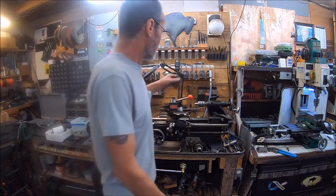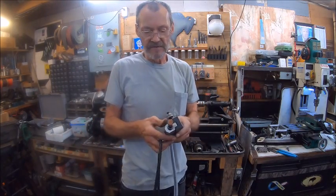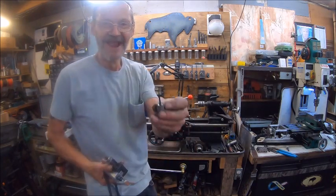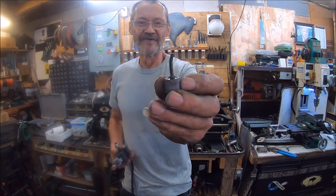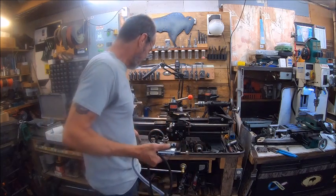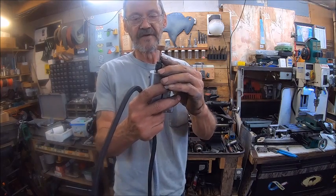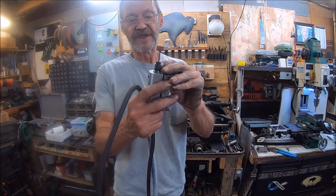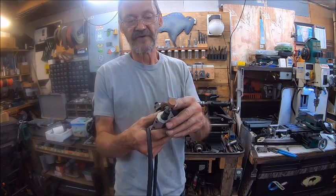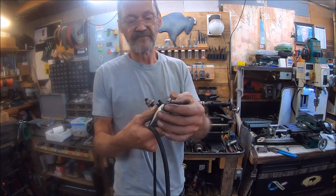Anyway, that's my tool post grinder. Temporary one. Lightweight work. I mean, very light. You seen what it did to this freaking shaft. Look at that. Bent that thing worse than a limp dick, I reckon. But I believe that I can stop that from happening just by shortening this shaft to however deep it goes into this, shorten it to just maybe a 1/16 or an 1/8 of an inch before it bottoms out. That way you got a little space between the collet and the tool.